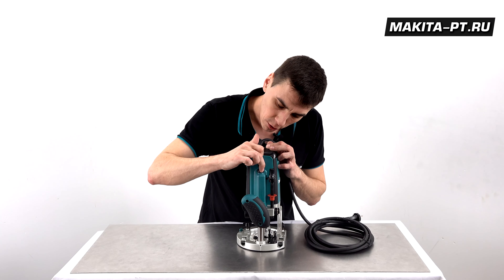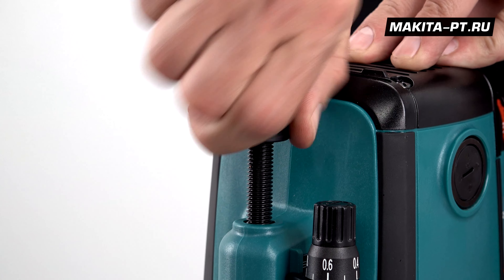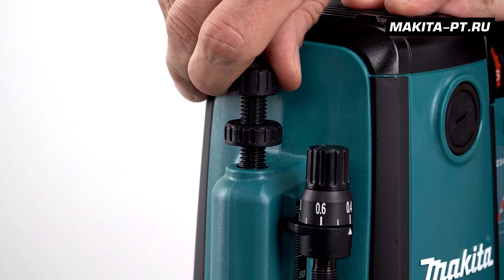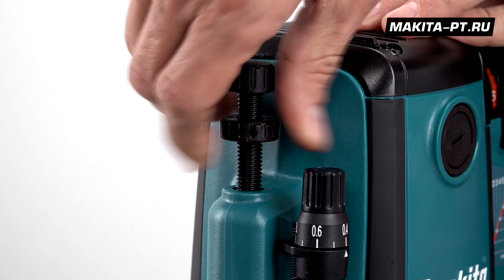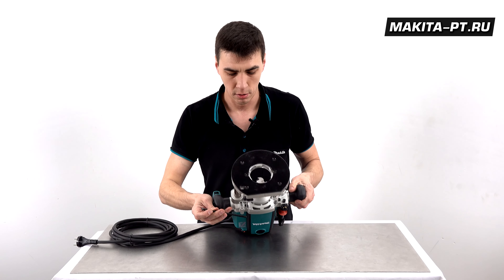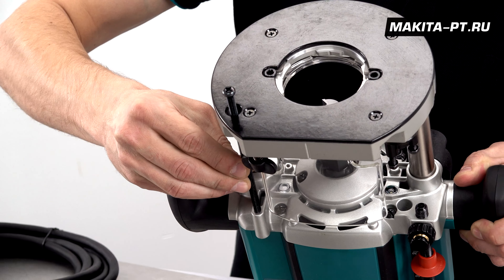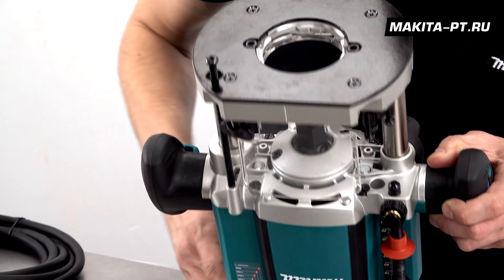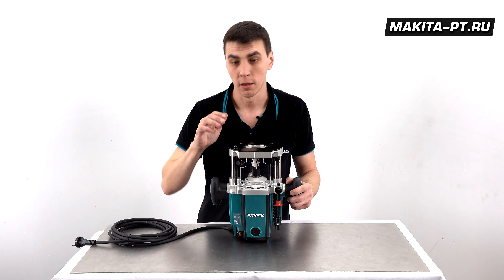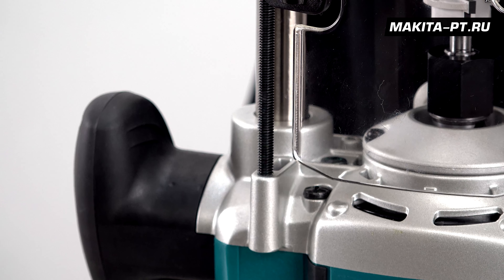Above the stop pin on the body you'll see a nylon nut that sets the upper travel limit of the body — it is not recommended to lower it too far, otherwise the bit will protrude dangerously. The table mounting screw (M6×135) installs from one end to the other and also enables the micro-lift function, with an adjustment of 1mm per revolution.